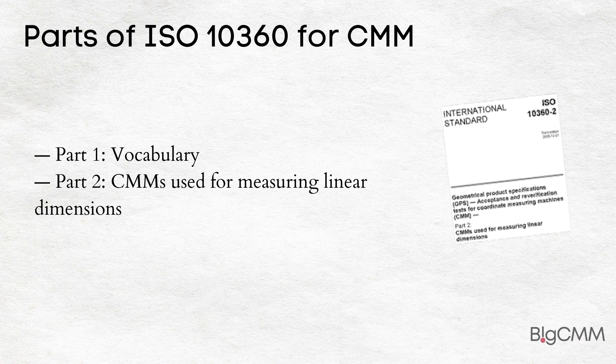The first part is vocabulary. The second part of ISO 10360 is the most commonly used, for linear measurement. The other remaining parts depend upon the feature of the CMM machine. For example, if I have a CMM which measures linear dimensions only, then I choose ISO 10360 part 2 standard for calibration of my CMM. This standard is a document referred to as a calibration procedure of CMM. ISO 10360 explains how to calibrate the linear type of CMM by slip gauge set or laser interferometer.